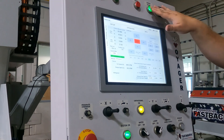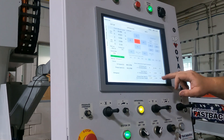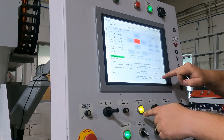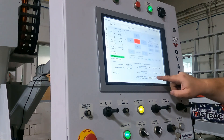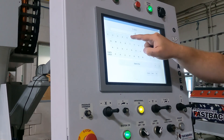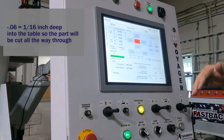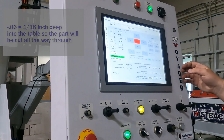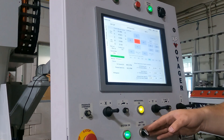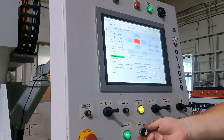When you do this, if it gives you an alarm, you probably forgot to turn on your spindle enable. Next step is going to be underneath the new orthogonal screen that pops up once orthogonal is selected. Down here, we want our blade to go a negative amount into the table — I am going to put a negative sixteenth in here just so that I know I am cutting all the way through the piece slightly into the table. Last thing is the water switch down on the bottom; because we are not running a program, we do have to turn the water switch on because we are manually cutting.